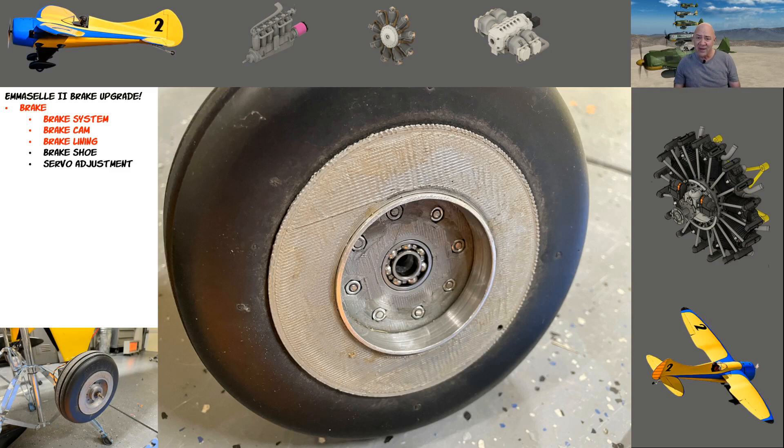I think where the ABS gets warm, cools, and then the next time it engages it peels off. A lot of people say why don't I put leather lining on the brake shoe itself — it's a good idea, but I haven't gotten to it. I'm afraid that if the leather were to roll off the shoe it might jam that wheel, and the worst thing I want is one brake completely locked up. I have enough elevator authority that if I landed with a locked-up tire on grass, it would just skid.